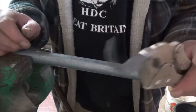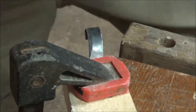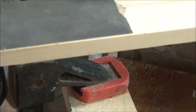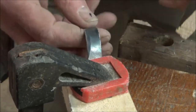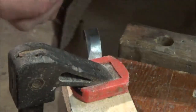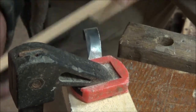After lots of faffing I've got it to that — I'm going to be happy with it, and that's the sort of action I've got now. I've made a stick with some emery paper on it. I've gone from 320, 600, 800, 1200. I'm not going nuts on it — I just want to get it a bit polished before I put a temper on it. All I'll do is rub a bit of water on there and try to get those file marks out.